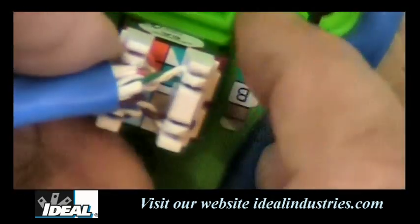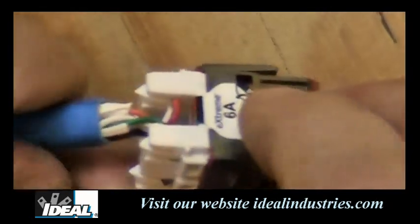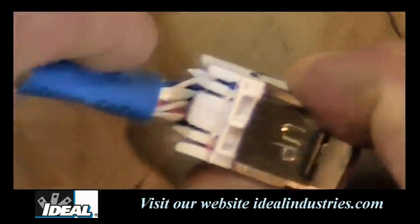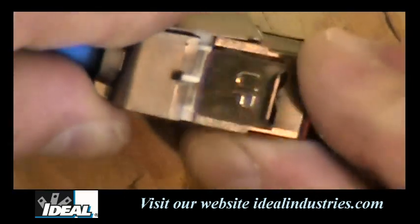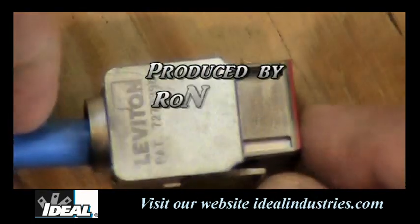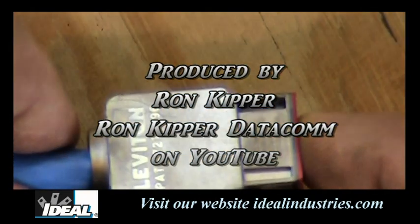There we go. The cable comes out the back here. I'm going to move the connector out of the termination puck. The last thing to do is put on the dust cover — it slides over the side, it's keyed with the connector, and we snap it together like that. And there you have a properly terminated Cat 6A connector onto a piece of Category 6A cable. Thanks for coming — my name is Ron with Ideal, and I'll plan on seeing you on the next one.